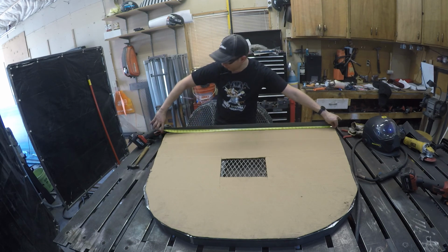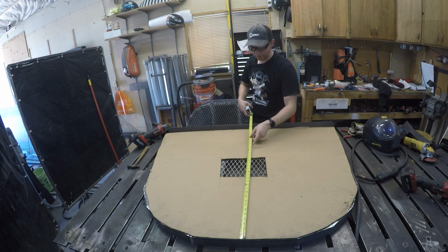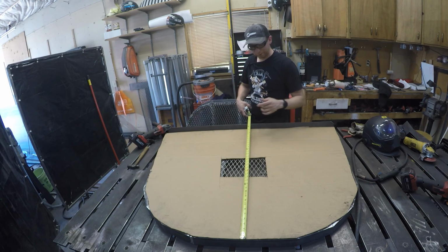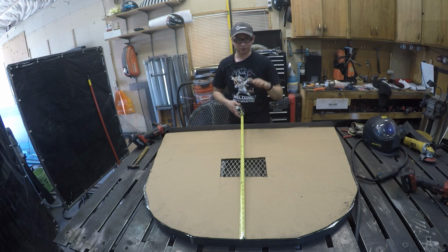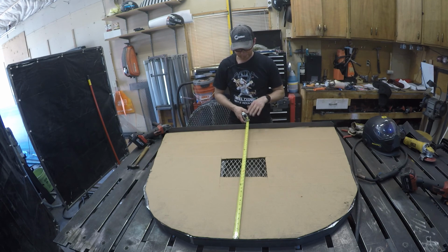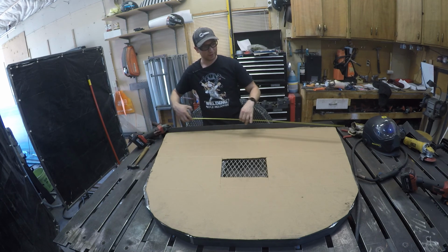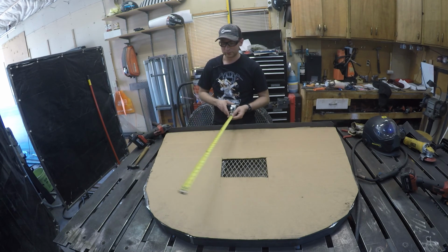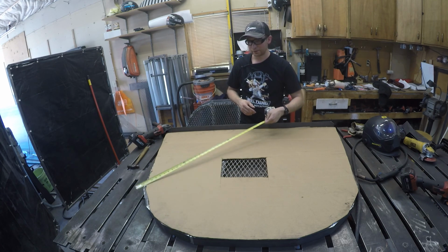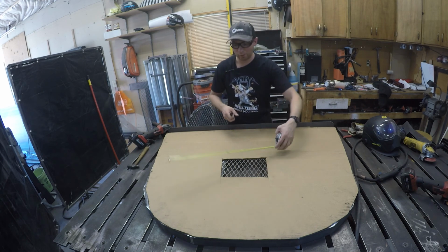You definitely need the overall width, and what's called the depth. You need to know how far out and how far wide. Once you figure out those, and again, write all this down as you're out there measuring your own window wells. So you're gonna measure this one out, see how far back it goes, how wide it goes. Then you're gonna wanna pull at least two, if not three dimensions across the corner. I would figure out about where my center is.